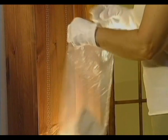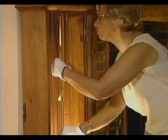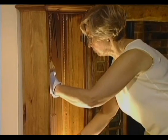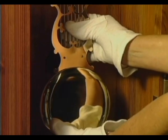We suggest you keep some packaging in case the clock needs to be moved again. Now unwrap the pendulum and, taking great care, attach it to the suspension rod in the top section of the clock. You do this by hooking it onto the fitment. Check that it is secure before you let go. Straighten the bob at the base of the pendulum if necessary.